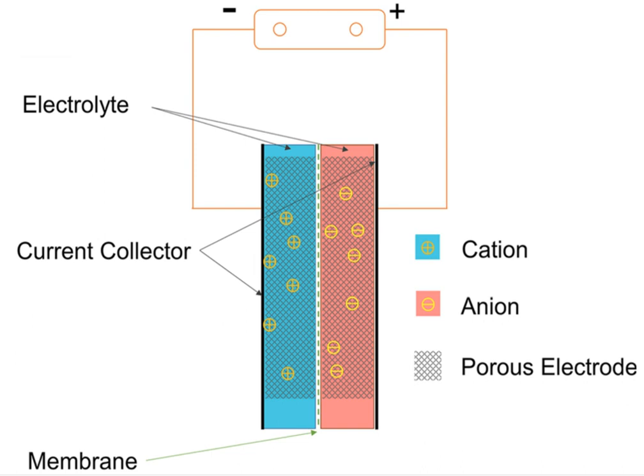Battery-type electrodes. Rechargeable battery electrodes influenced the development of electrodes for new hybrid-type supercapacitor electrodes as for lithium-ion capacitors. Together with a carbon EDLC electrode in an asymmetric construction, this configuration offers higher specific energy than typical supercapacitors, with higher specific power, longer cycle life and faster charging and recharging times than batteries.